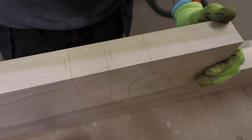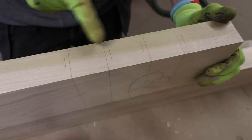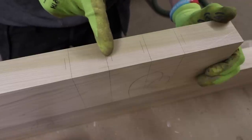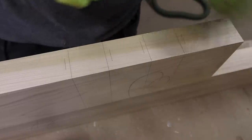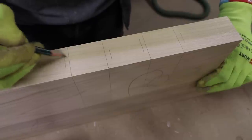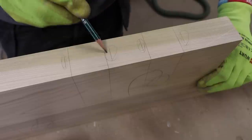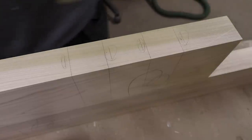So the setback or groove will push right up square to this edge, and there'll be a bit of wiggle room in your joint to get your joint together, and that's going to create a bigger wedge at the back here. So sorry, I've told you wrong. You want a bigger wedge room on this bit here and this bit here than you do here and here, because these two will equate for the wiggle room of getting the joint together.